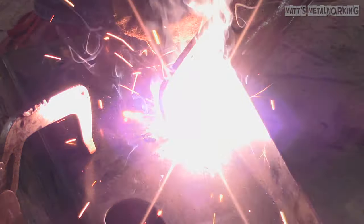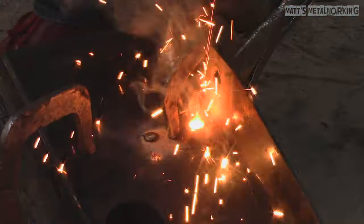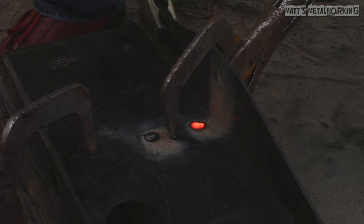Inspect the repair. If you do find any pockets, that's not an issue as you can clean up the surface if it's flux core and add more weld. If you are working on a thinner gauge metal such as found on body panels, short tack welds would be recommended instead, as this can keep the heat down reducing the chance of warpage.